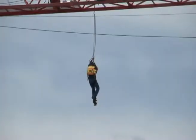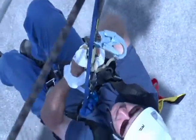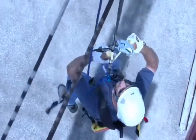You're going to stand up and attach the system to the front anchor point of your harness. Then you will step up and release the shock-absorbing lanyard from your dorsal attachment. Slowly lower yourself so that you have weight on the egress system. You can get out of the step-up lanyard and make sure that you have everything clear for your descent.